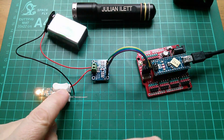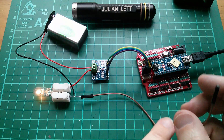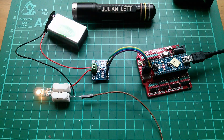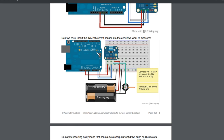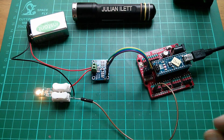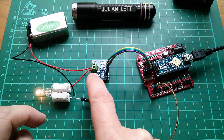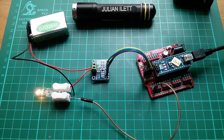I've slightly rearranged this — added a little wire so I can connect a DuPont connector, and I'm checking the Adafruit booklet to confirm the wiring. Yes: the Arduino connects to the I2C pins on the current sensor, VIN plus and VIN minus go to your circuit, and then there's a ground line from the minus side of the circuit back to Arduino ground. All the black connectors here are ground so I can connect to any one of those.